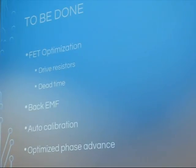That's actually something that we left the slide out, is that since this encoder is absolute, you only need to check its position twice per revolution. All right, so if you look at the maximum speed for these beautiful, very fast motors, and if you only have to check twice per revolution, that's plenty fast to always know where that thing is all the time, almost. I think it's up to 80% of the motor speed. But if you had a 4,000 count per revolution encoder, trying to keep up with that, you'd have to be doing that 2,000 times or 4,000 times faster.